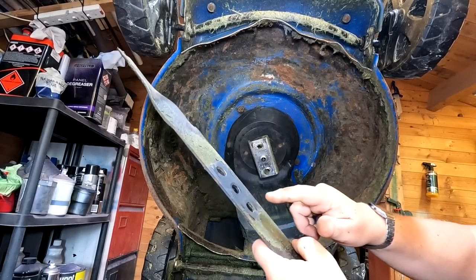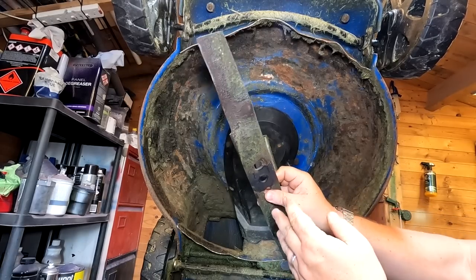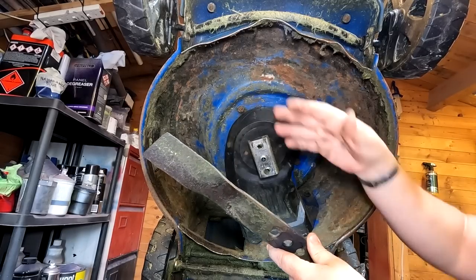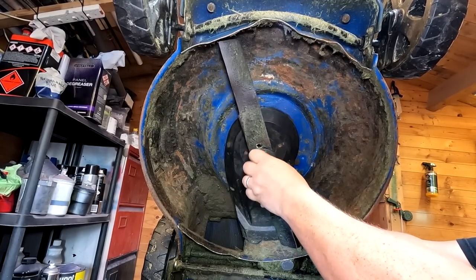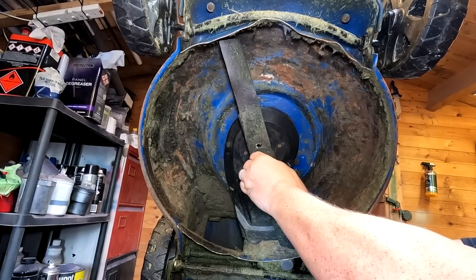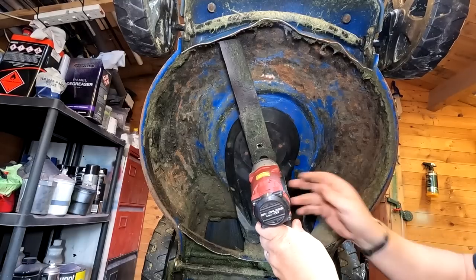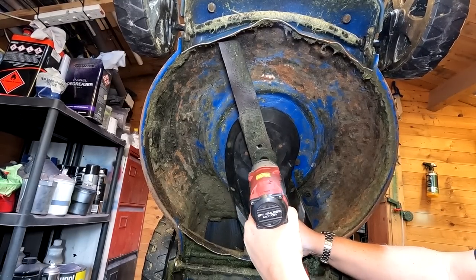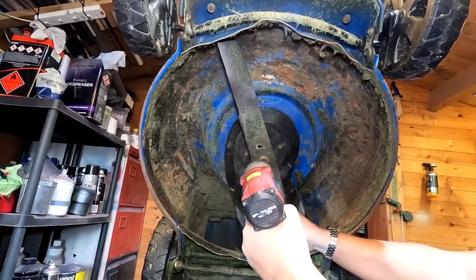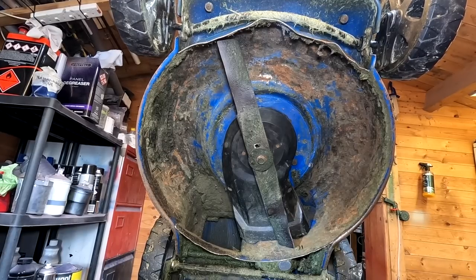Just replace our blade. Our blade's got a square cutout and an oval cutout, which matches the square and the oval on there. And don't forget — when you put the blade on, the sharp edge faces upwards, just like those flutes face upwards. So let's put that back in place. This bolt head — I mentioned in the last video I thought it was a 17mm, it's actually a 16mm. It was all crudded up on the head, that's why I thought it was a 17mm. The dome washer, when you tighten it down, produces the force that holds it in place.